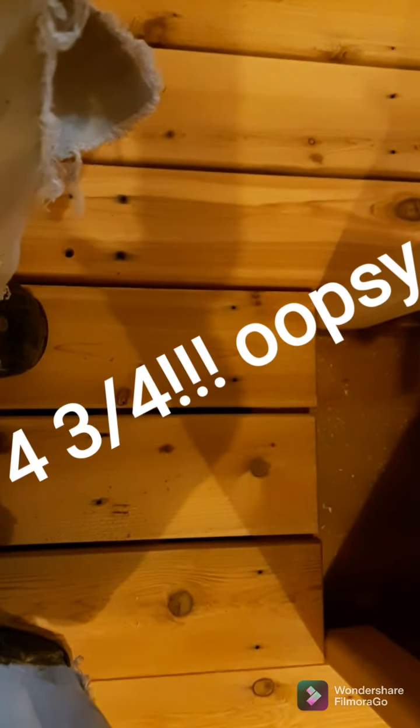The spacing worked out really well. I had to trim these just a hair — I think seven and three-quarters ended up being my width for these planks. This one was just shy of seven and three-quarters, so that's minus a sixteenth. I think I have it backwards because the front edge is even, so I can turn it and it'll be fine.